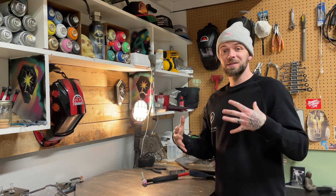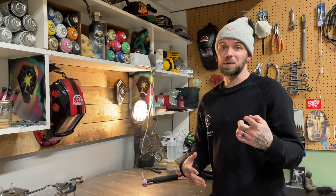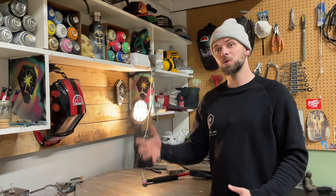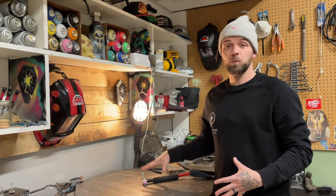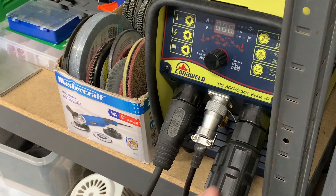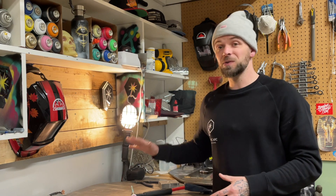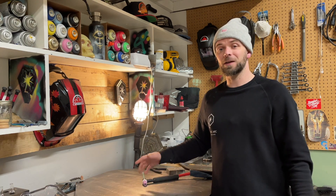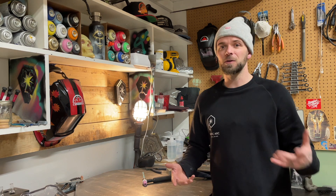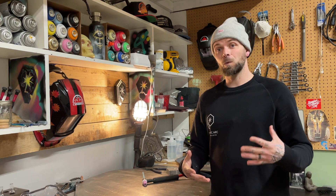A lot of people ask me if it's important to get a water cooled torch when starting out learning. No — it does help immensely, let me tell you that much. There's many times I've been welding aluminum and I just have to take a break because the torch gets too hot. I'm lucky enough to have a couple of torch leads. So once one gets too hot, I'll just disconnect it from the machine. This whip has a Dinse style connector — it's basically a quick connect, just plugs into the machine, super simple. So I usually have a couple of these ready to go. When one gets too hot, I just swap it out for another one that I have set up already with a cup. It's a good move if you're going to use a gas cooled or air cooled style torch to keep things moving.